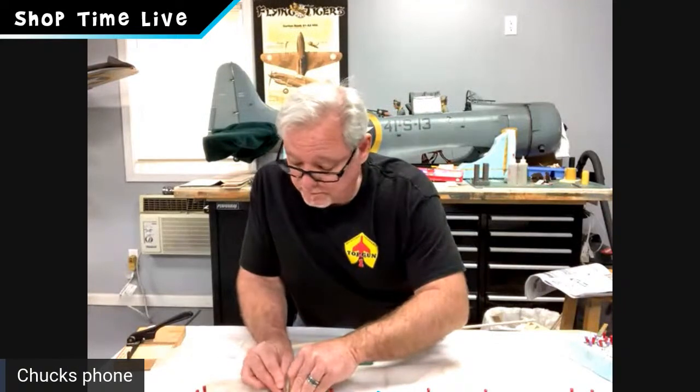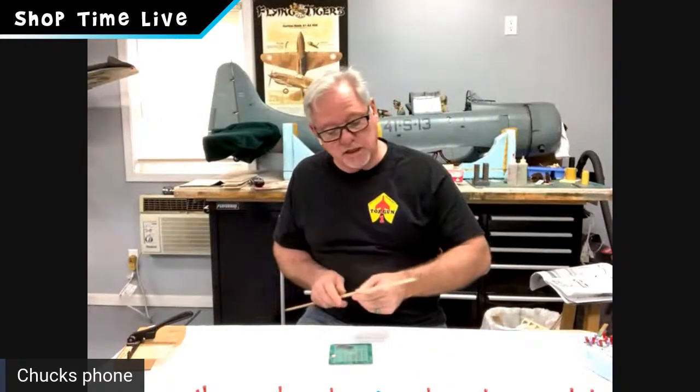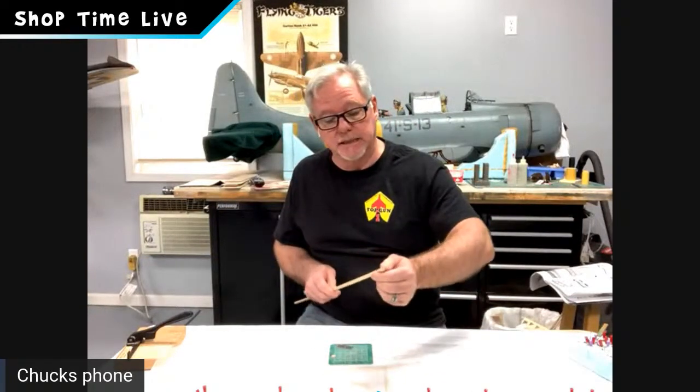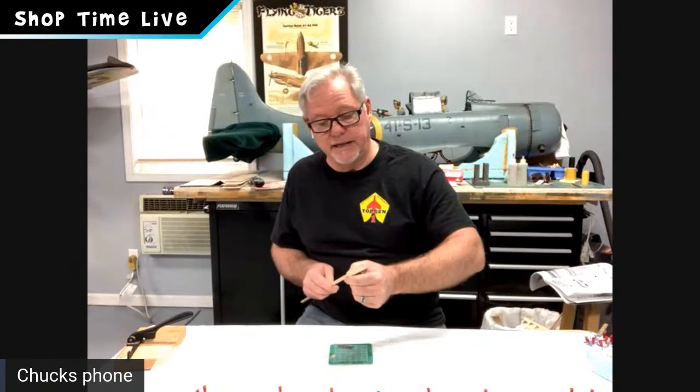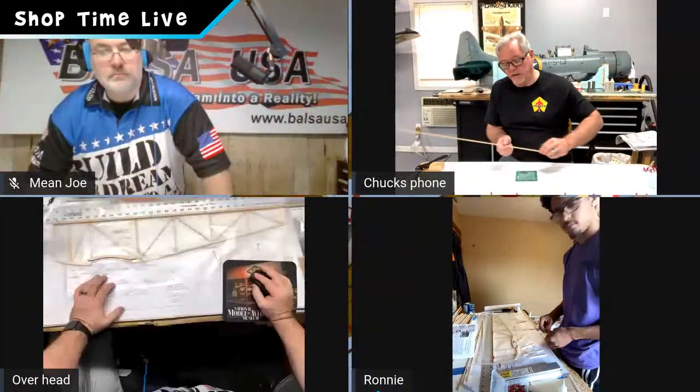All right. I've got my top longeron pinned down really good and rolling now. Okay. Step three talks about the lower round longeron, which is, once again, my softer one. And it talks about putting a 6-inch slit right down there to help the bend. And Joe, you've got that overhead camera. That's probably a good spot for you to jump in and maybe show that cut and how that affects the airframe.